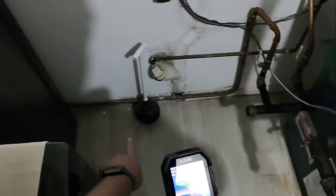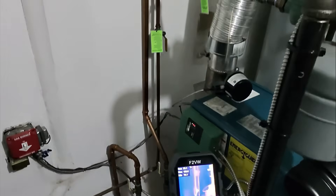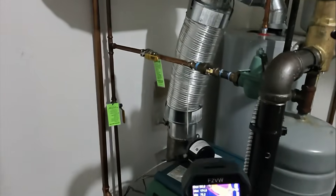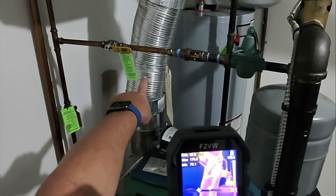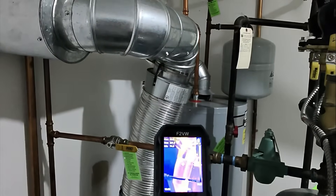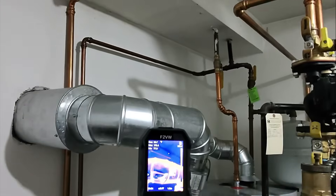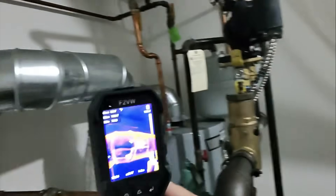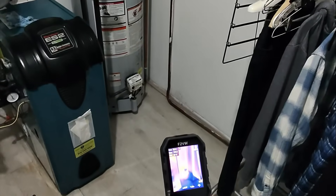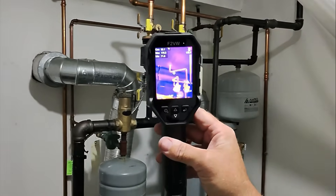There's the basement — the ground floor. And there's our upstairs chimney and flue piping. They give us this corrugated flue piping to gain efficiency. 225 degrees — no, actually 137 — and here it is 175. Big difference. And there's our water heater, and there's that piping leaving the boiler going to our ground floor.